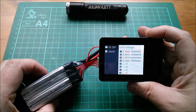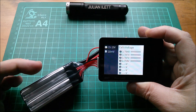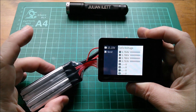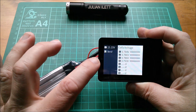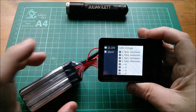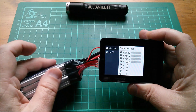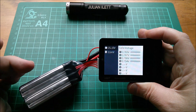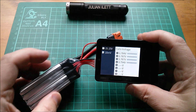This one's a little bit higher — cell 4. I imagine if it's going to take all 4 cells down to 3.6 volts, then it will rebalance them at that mid-voltage. Not that that's terribly useful, but it should bring these cells into better alignment than this 10 millivolts. It may not, of course, because the chip inside here which is measuring voltage of the cells was only doing that to two decimal places.